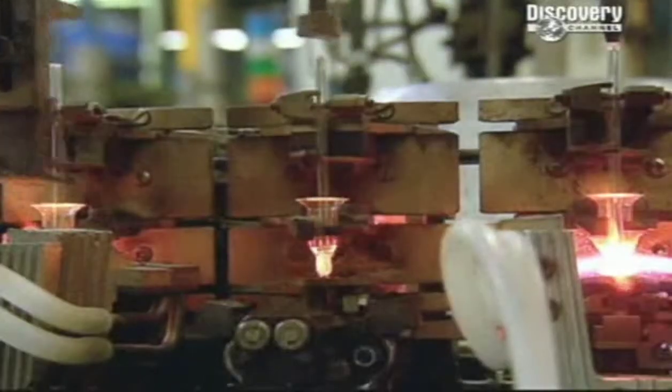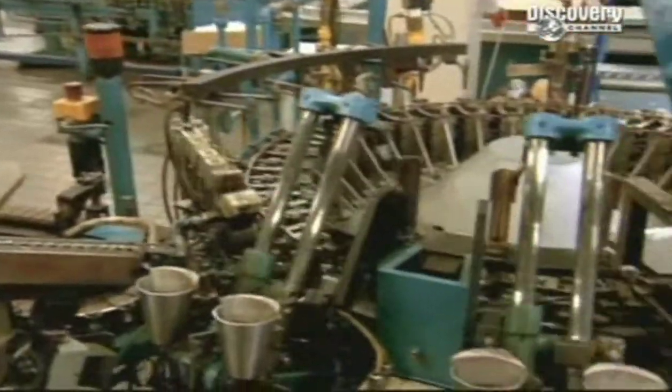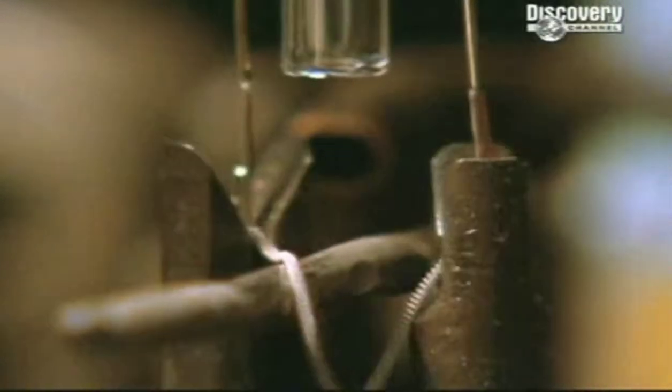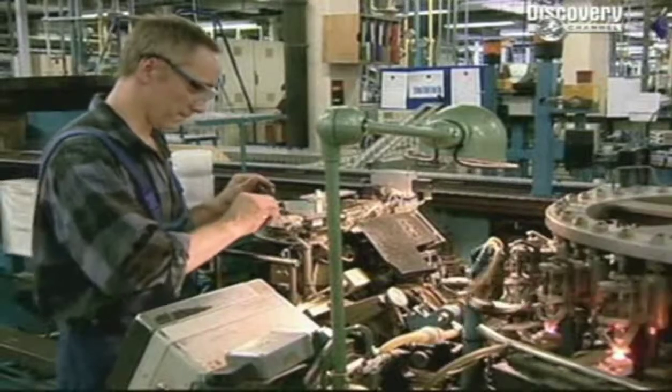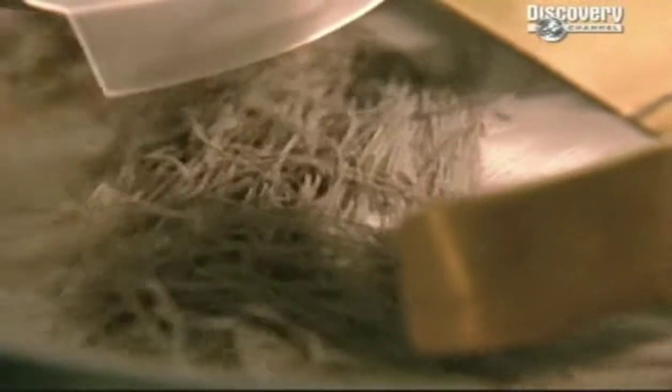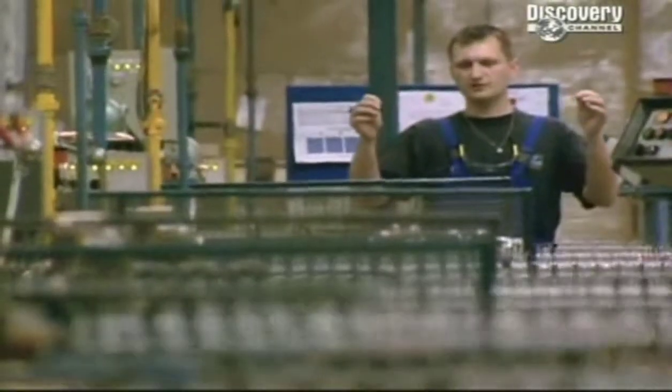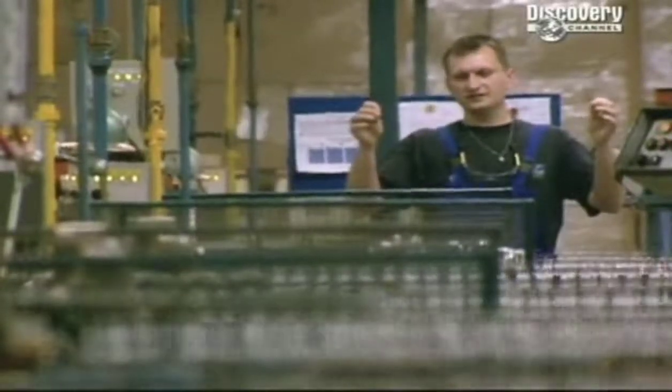All of these will hold the tungsten wire in place. The stem is heated to melting point, the wires are added, then it is clamped and gradually cooled to reduce the chance of cracking. Now the stem can be married to the bulb, and all that's needed is the tungsten filament itself. The filament in the light bulb is made of wire — when stretched, it's a metre long. People don't realise how many machines and complex processes are needed to make it.